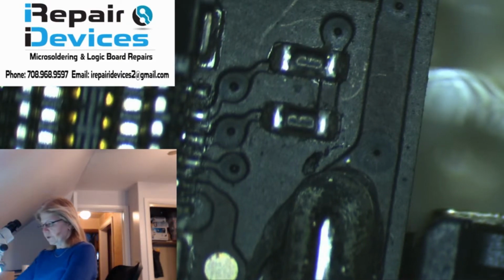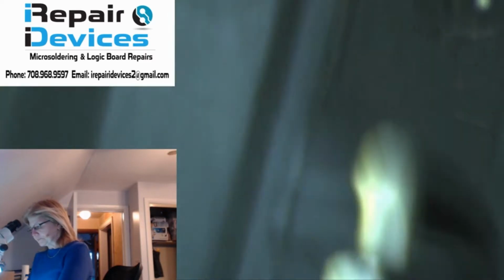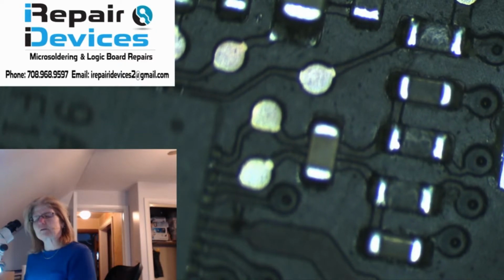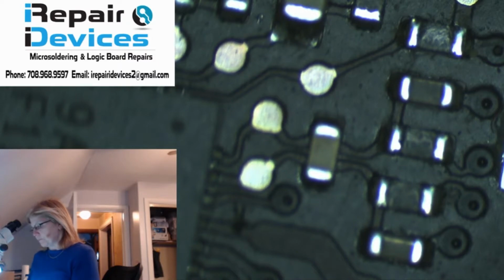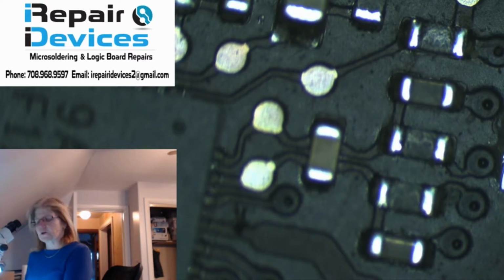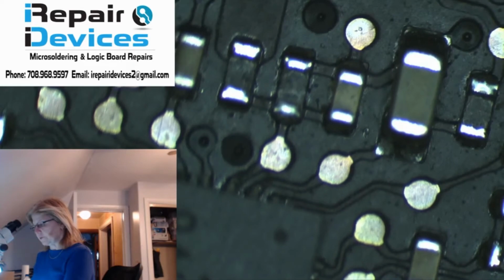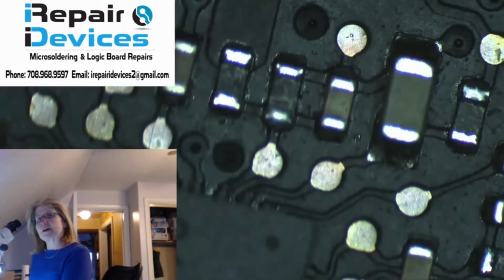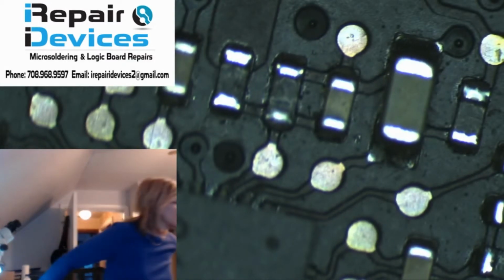Now, what I have noticed in the past, I've worked on a similar board like this, and I would get the PP3V42 line, but once I plugged in the connector, the line would short out. So I would not blame this board. I went to the board that plugs into it, the actual sensing board. And let me get it real quick here.